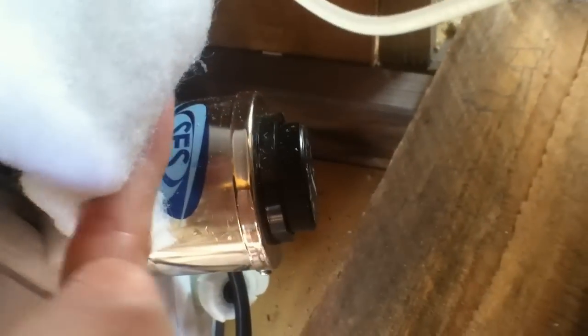All right, guys, so it's day two on the job site, and you can see right here that I've installed for Randy, for his customer, one of these SEAS water heater elements that are adjustable, and we've got the leads coming off right here. You're hot and you're ground. What I've done is I've wired from the dump load the ground coming over, and that'll wire nut in with this. And then we're also going to have the ground that's dropping in right here from the switch, and that's just going to let it go on and off. And the hot will tie in direct to the battery over here as far as the switch goes. That way when you turn it on, it's pulling from the bank.